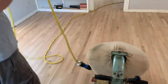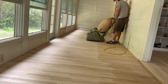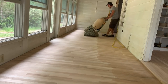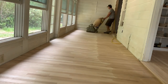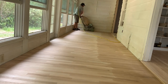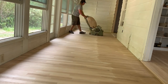Now that the entire floor has been rough sanded, I'm going over it with that fine grit paper. I try to make sure to overlap my lines — you see me here going a little ways past midway on this room. And when I turn the machine and come back, you want to make sure not to leave your line straight. You don't want a straight line down the middle of the floor where you've pulled each direction. It would be pretty obvious.